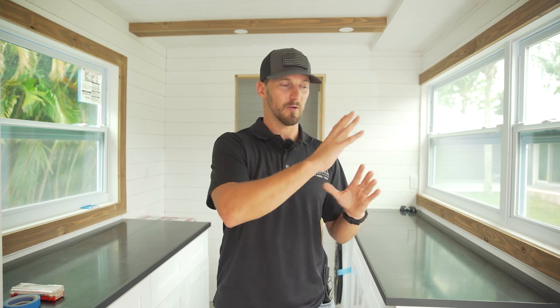So why don't we start with why we chose shiplap this time instead of drywall. What we realized on our first build, the 40-foot — and if you haven't watched that, you can check that video out — is that drywall is probably not going to travel very well. We kind of knew that in advance, but that container was just going to be built and used as our template to figure out what we did like and what we didn't like. And we realized real quickly, since we're going to be shipping these things around, that we didn't really want to use drywall because there could be stress cracks. When you're driving it down the road and you hit a bump, it's going to have all different repairs that need to be done when it finally gets to where it's going. So we figured we'll use shiplap on the next one.